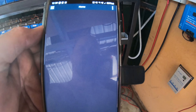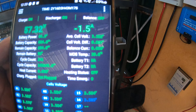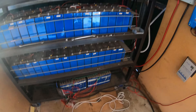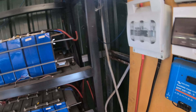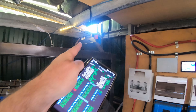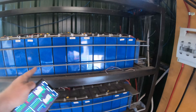The lower cell is 3.57 volts and the higher cell is 3.587 volts — that's excellent. I think if you don't beat the hell out of these batteries they're actually really good; we never get anywhere near the limits. The third shelf is the best as far as cell difference — it's currently at 0.006 volt cell difference, which is nothing. Even though we tried our best to use the same gauge cable, the cable runs are not exactly the same length, which is the problem.